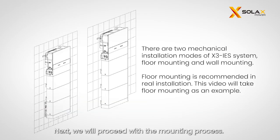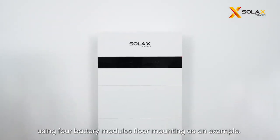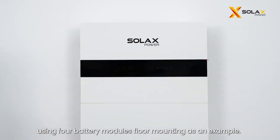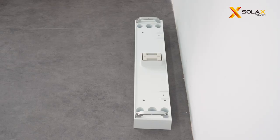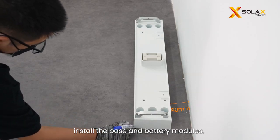Next, we will proceed with the mounting process. The X3-IES system supports 2 installation methods, floor mounting and wall mounting. It is recommended to install the IES system with floor mounting. In this video, we will demonstrate the mounting steps using 4 battery modules floor mounting as an example. After unpacking, firstly prepare and install the base and battery modules.